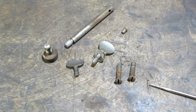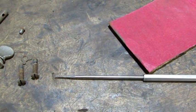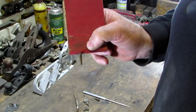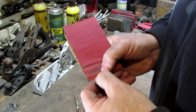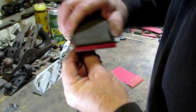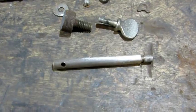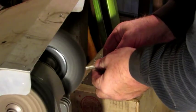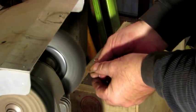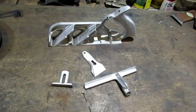While that paint dries, the last thing to do is to clean up the small parts. I'm going to start with the screw slots using a dental pick and some folded up sandpaper to fit the slot. The dental pick works good to get the initial rust and crud out, and then I've got four layers of 150 grit folded to fit tight in the slot — that's going to make it look like new again. For the fence rod, I'm going to scrape it first and then go over it with 150 grit paper. After that, everything goes over to my wire wheel. Small parts are done and I'm giving them a coat of rim oil.